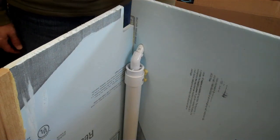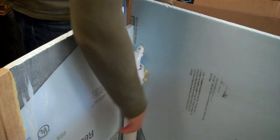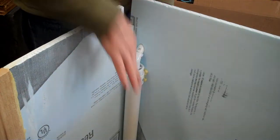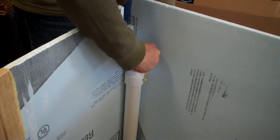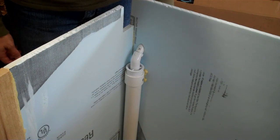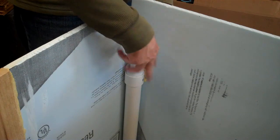It'll also add a little bit of strength, having fiberglass all around this thing sticking through. I'm going to be putting some fillets of fiberglass on either side here, and I'll have fiberglass going over it. But I figure having that thing going through the hole, as well as an exit from the inside of the boat, will also be useful just for strengthening up the whole joint.